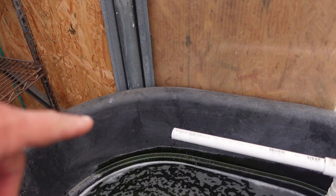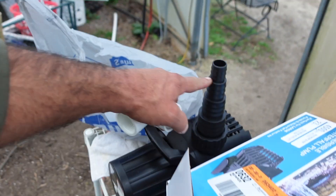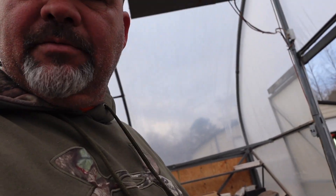The old pump is three-quarter inch pipe. We've got a three-quarter inch main header but we've got to go from three-quarter to one inch pipe because this new pump starts at one inch where the other one started at three-quarters. So what I'm going to do now is get some PVC glue, glue all this stuff together, get everything ready to set the pump, and then I'll give you guys a shot of what we've got before we start filling the tank back up.